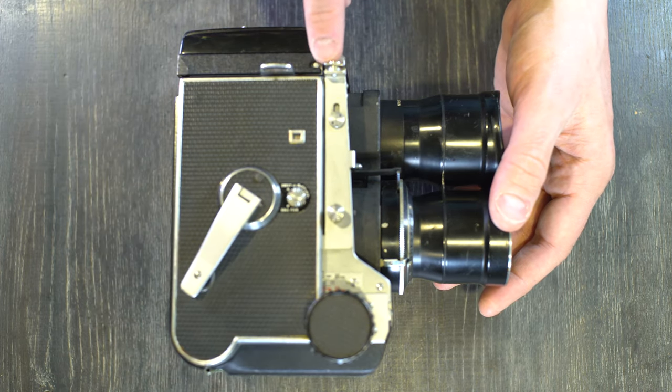In the second video we'll go into much greater detail on how to use the camera. Some things not to do: don't store the camera with tension on the shutter. These leaf shutters are clockwork mechanisms activated by springs. If you arm them and don't fire before storing, the springs stay under tension, develop a memory, get weaker over time, and your shutter timing will go off. Always trigger the shutter before putting the camera away to release tension from those springs.